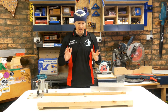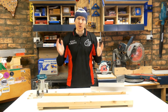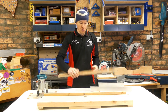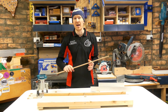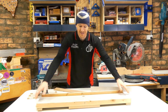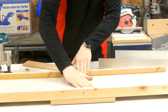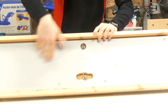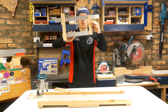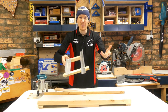The last of my DIY jigs is the most complicated — probably the one that you'll build last after you've made the other ones — but it is incredibly useful when you start stepping up from dimensional timber that comes from the shop in a certain size, to rough timber where you're going to have to get to the size that you require for the project. That is a router sled. I didn't rebuild this one because there's a little bit to it, but as you can see, this is a base that screws onto my workbench using these little wing nuts, and effectively all it is is a nice slippery piece of form ply and two rails. The sled itself has two rails to sit either side and I had some aluminium angle lying around to hold my router.